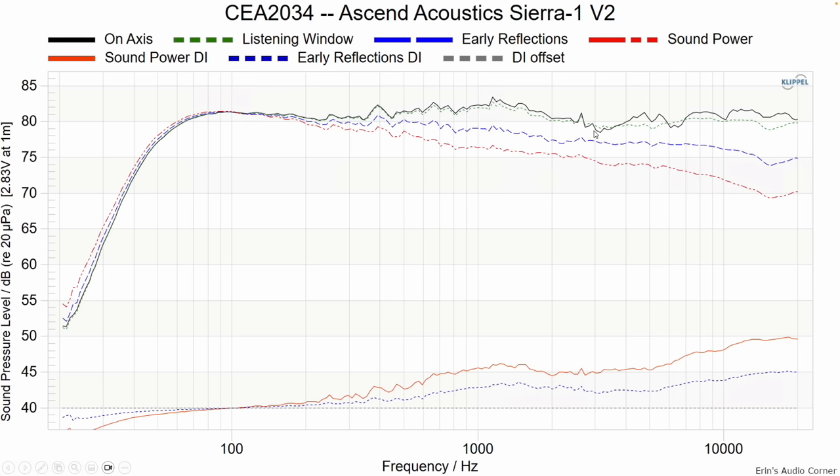Let's talk about distortion. At 86 decibels at 1 meter versus 96 decibels at 1 meter, this 5.25-inch mid-woofer is showing signs of distortion at the higher output levels. The multi-tone distortion also shows some higher levels of distortion at the highest output — around 14 volts, which equates to about 96 decibels targeted. I didn't really notice that in my listening, which could be because I was listening for other things. Distortion is one of those weird things where you don't hear it until you hear it. If you treat this speaker like it's got an 80 hertz crossover, that mid-range distortion drops down pretty significantly, which tells me there's something about the motor topology in the mid-woofer causing some extra mid-range distortion.